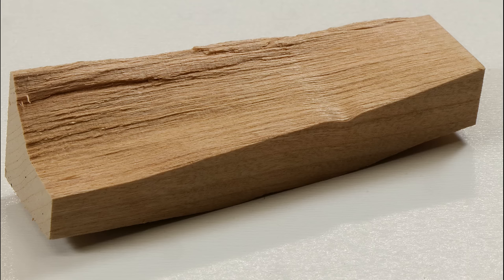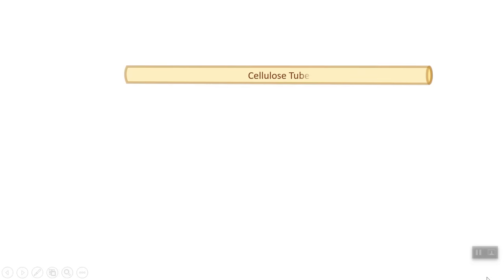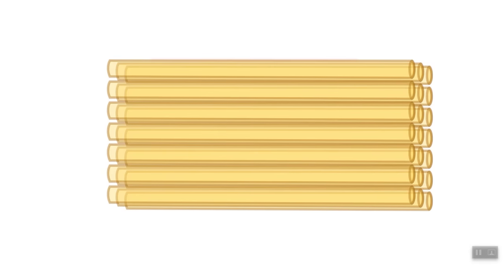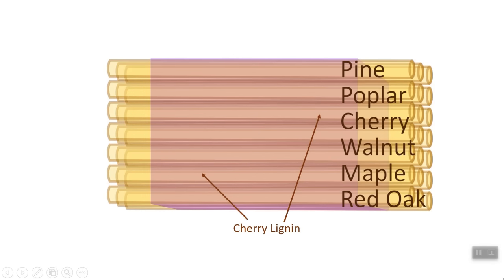Before we get into the testing, I want to be sure we're all on the same page with terminology. Wood derives its strength from cellulose fibers. These fibers are laid down in layers of long, strong cellulose tubes, almost all running in the same general direction — up and down the tree. We'll call this the grain direction. The tubes are held together with lignin, an organic polymer much like glue or plastic — it coats the tubes, sticks them together, and fills in most of the spaces. If we were making fiberglass composites, the lignin would be the resin. Each species of wood produces slightly different versions of both the cellulose tubes and the lignin, so we need to test a bunch of different species.